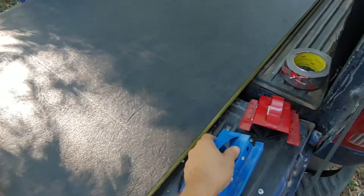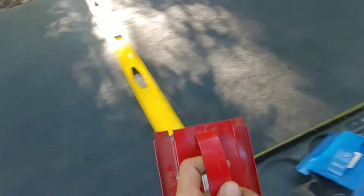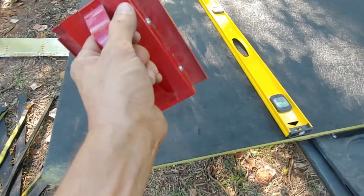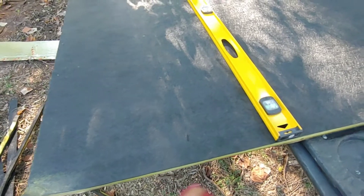Really all you have to know is that these tools add two and a half inches to where your last measurement was, so it's really going to screw you up if you go to measure a 16 inch duct, cut it, and then it turns out to be an 18 and a half inch panel.